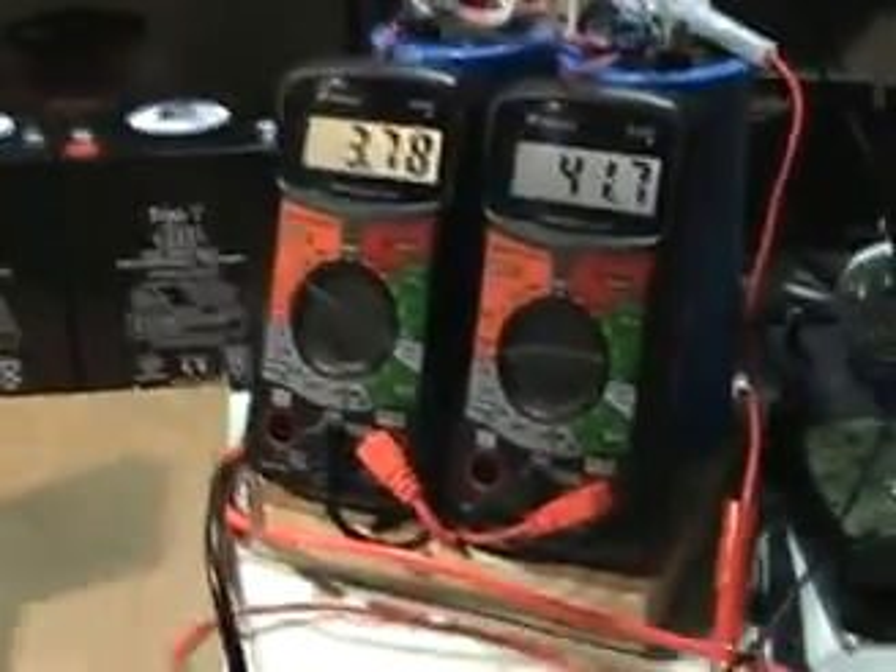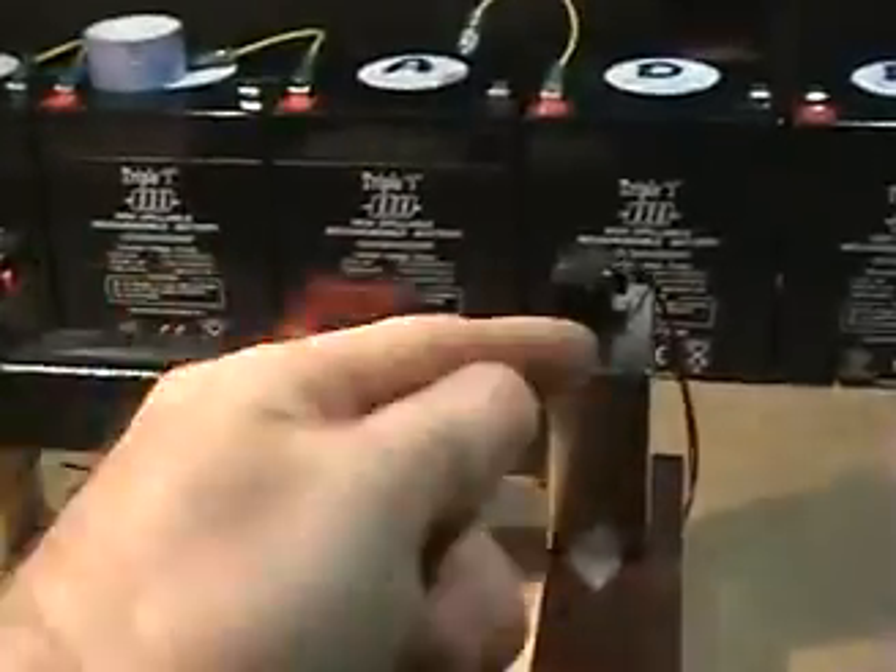The power efficiency would get much better if I had two bars — like a dot matrix printer guide — to guide the coil perfectly without it rubbing on the bar. Right now there's a lot of friction from it rubbing on the bar; I've got oil on it, but there's still friction. The motor is now working without a signal generator and I can input whatever voltage I want. The more voltage I put in, the faster it pulses, but the harder it hits each magnet on each side. At this voltage it's working nicely and smoothly, so I wouldn't want to increase it.